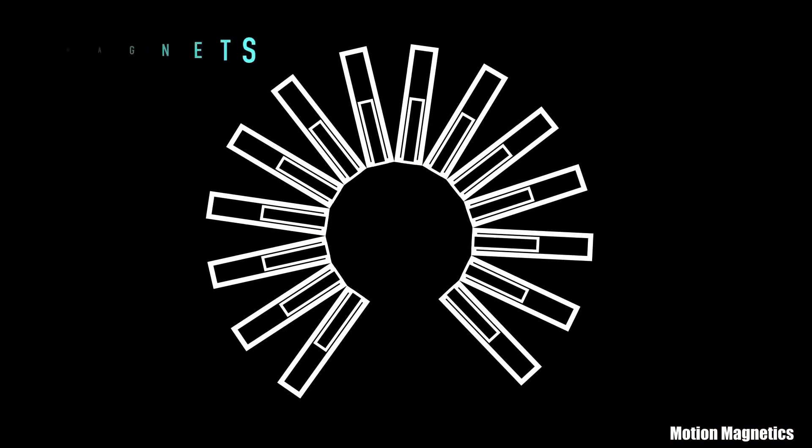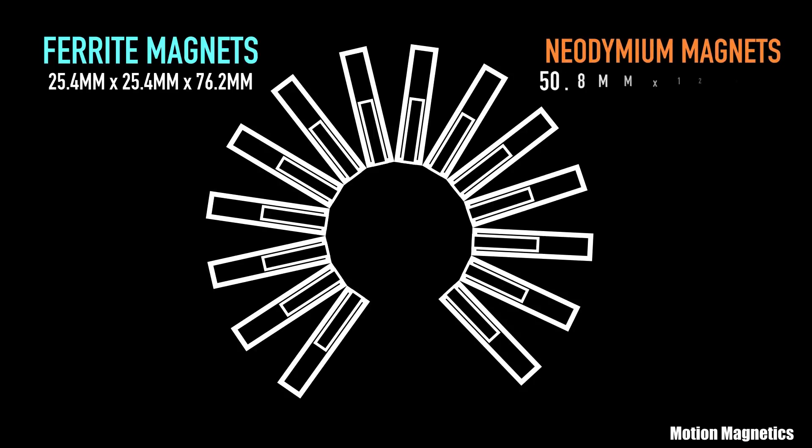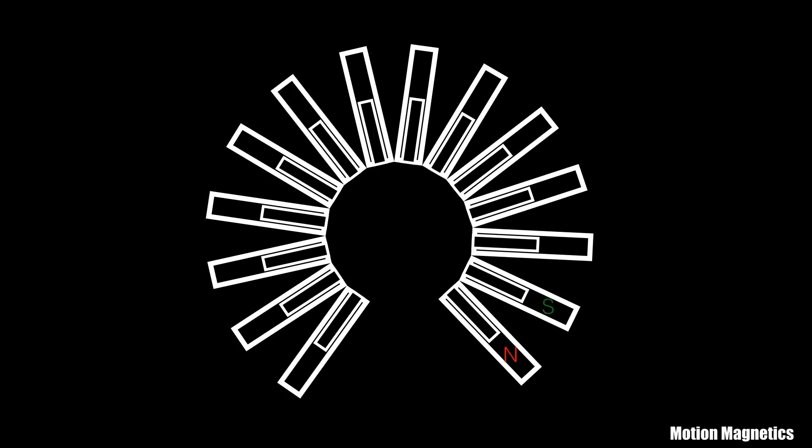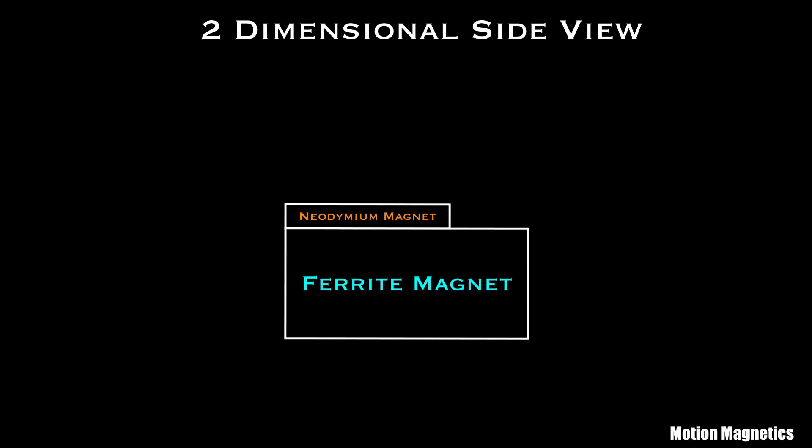The stator assembly is composed of ferrite magnets capped with neodymium magnets. They are alternately placed north-south facing up. If you've seen my videos on the magnetic spin vortex, the alignment of the magnets may make more sense to you. The spin of the magnets arcs from the center point of the magnet, so I'm focusing the spins from one side of the magnets on the pyrolytic graphite and aluminum materials on the rotor.